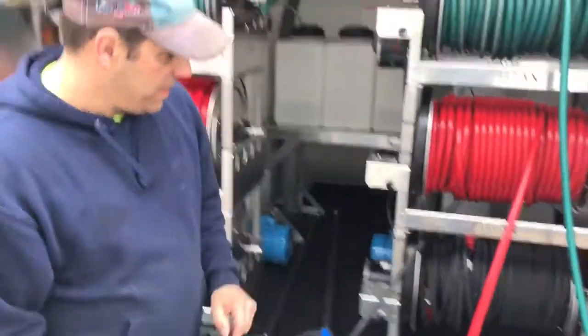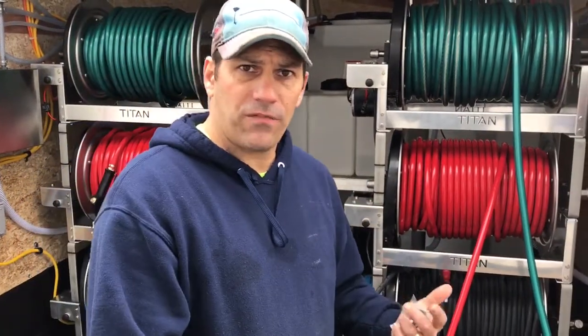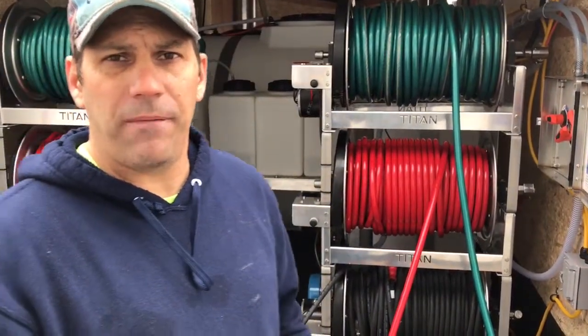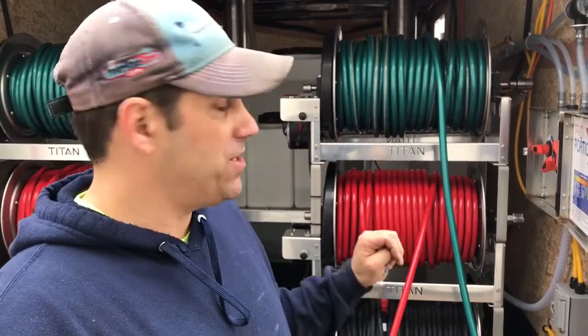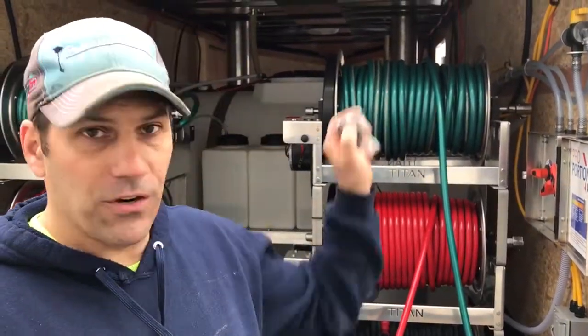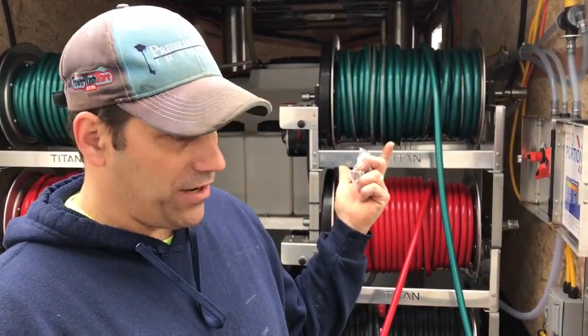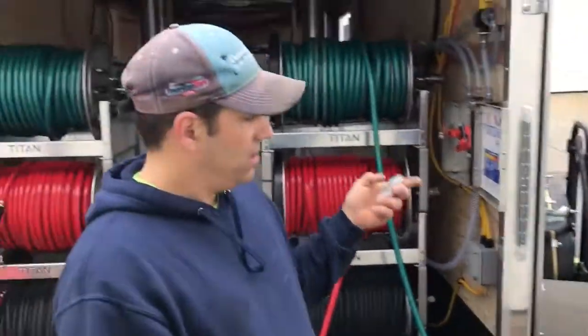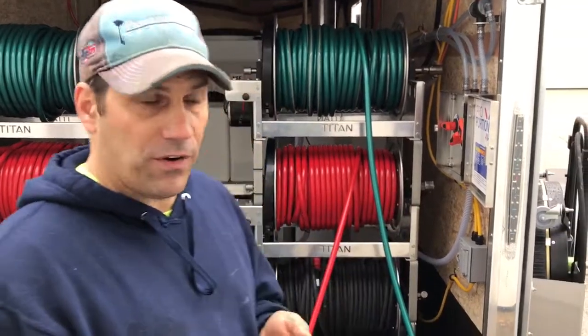One of the things I've done is I've let off the trigger here, and what we did is we installed a bypass kit on the booster pump that will allow you to let off the trigger and let it run in bypass, just like a pressure washer. Now you can typically run it in bypass for about three minutes before it really starts to heat up and start causing potential damage to the booster pump. If you are going to run it for a long time, you can just shut it off with the remote control. You can also just squeeze the trigger every once in a while if you don't have a remote control.